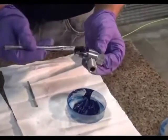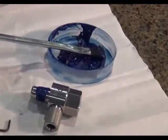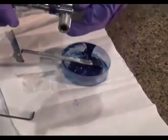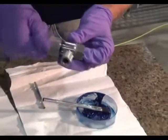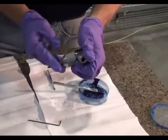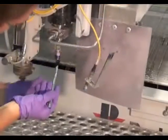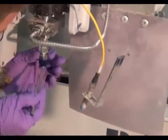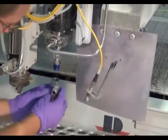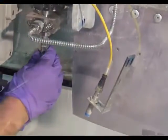Screw the abrasive inlet back in. Apply blue lube to the threads. Insert the nozzle tight to the bottom of the mixing chamber. Thread on the standard nut. Slide the o-ring back over the standard nut. Apply blue lube to the threads. Thread the abrasive body back onto the adapter. Tighten with two wrenches.